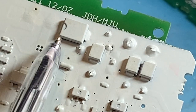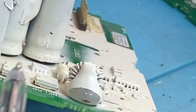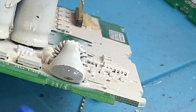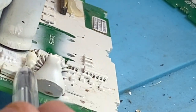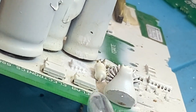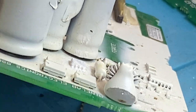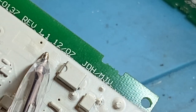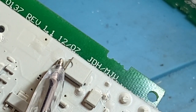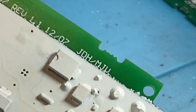And because you've got the join there, and the way both of them connect, both output stages connect to a common point, well, the energy will go through that diode, then through that diode, and back into the clamping circuit. So it doesn't need this diode that was there. So someone woke up and said, oh, we only need three diodes, we don't need four. So they saved themselves a dollar or two.